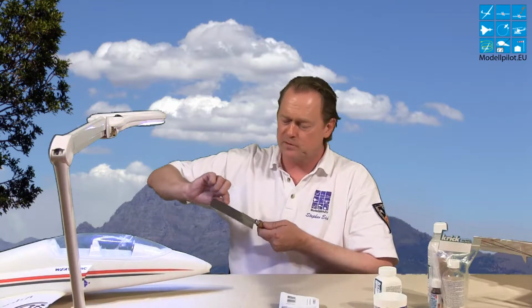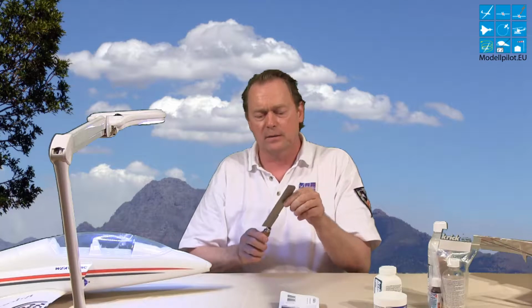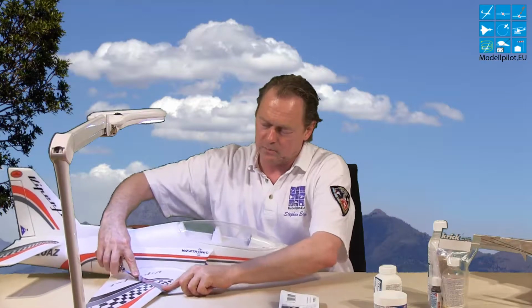It's a very good detail and you can use it as well like a saw, the cutting saw. And you know the other, the razor saw, there the back is to this point here, and you can cut the wood like that. And now you can cut it also, but because there is no shaft to this point, you can go through the wood all the time. Be careful, because if you go up, you can break it. It's not easy. Everything goes this way down through the wood, and you have a very, very good cut on the line.